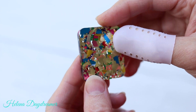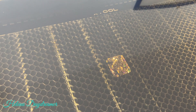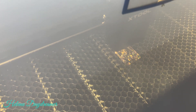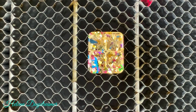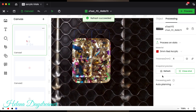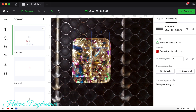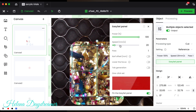This piece of acrylic is about 4mm thick, and I kept the settings the same — only changed the thickness. But it didn't cut all the way through, so I placed this sample back on the machine and tried to cut it again. I aligned the design with the initial cut using the close capture feature. This time I changed the settings and it cut through nicely and precisely.